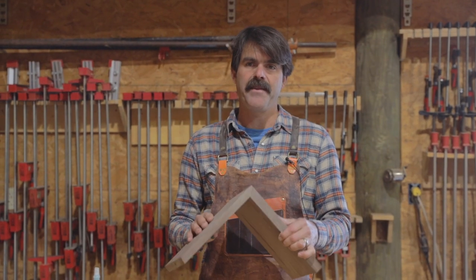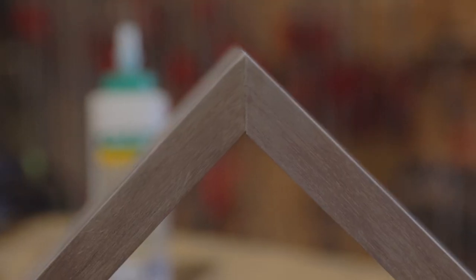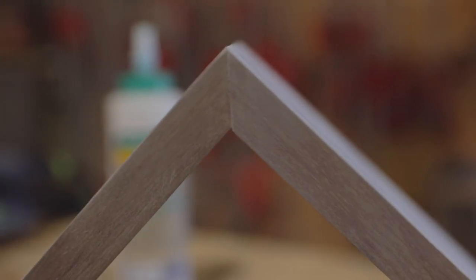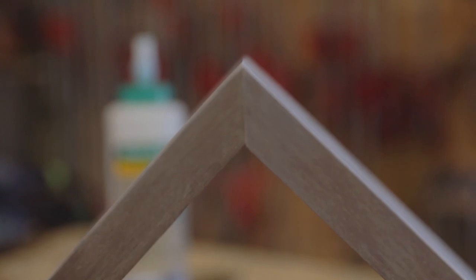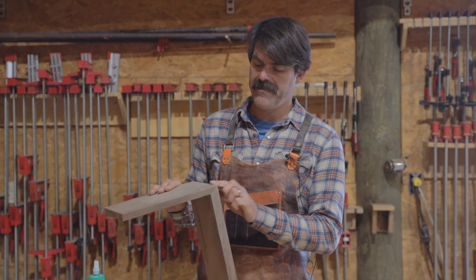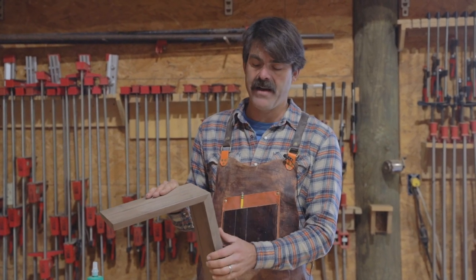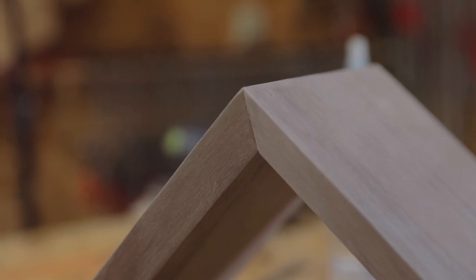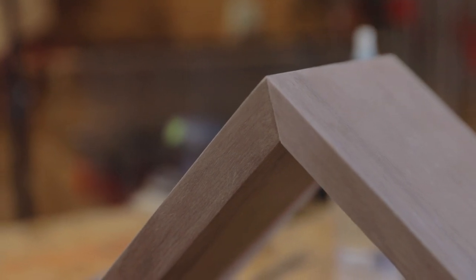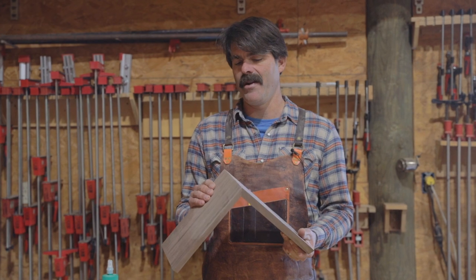As you can see, we tied up this miter joint pretty well just by the use of slivers, some glue, and sanding. But really the key is to meet these points perfectly, fill in any gaps you have, and fill it with the same material if you can — such as the walnut here. In the end, nobody would ever know that what happens so many times never happened this time.